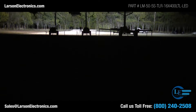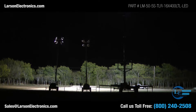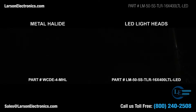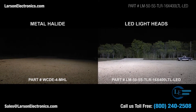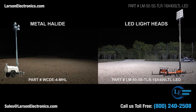The following video displays the light output between the Larson Electronics Mega Tower and a traditional 4-lamp metal halide light plant. The 30-foot elevated metal halide tower on the left illuminates a 50,000 square-foot work area with four 1,000-watt metal halide light fixtures. The Mega Tower on the right illuminates the same 50,000 square-foot work area with 16 500-watt LED fixtures elevated to 50 feet. Notice how the color and intensity of the work area is greatly improved when lit by the LED fixtures.